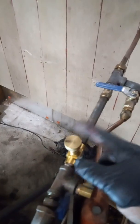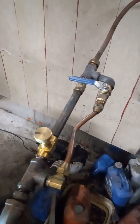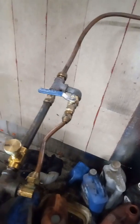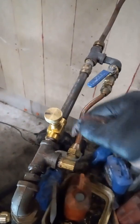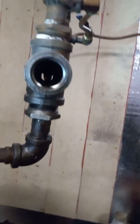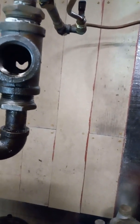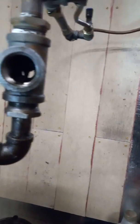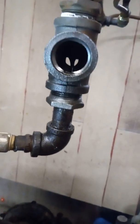So I turn the oil on here - I've got a needle valve here for a more precise feed, but it all depends on the viscosity of the oil I get. This other one is more of a direct bypass, so I can shut either one of these off. And if you can see in there, you get a flow of oil. Right now it's pretty thick oil, it's pretty cold, so I'll get some oil dripping in there.